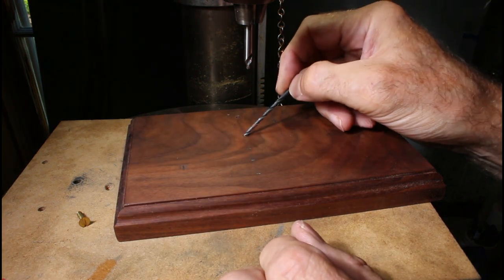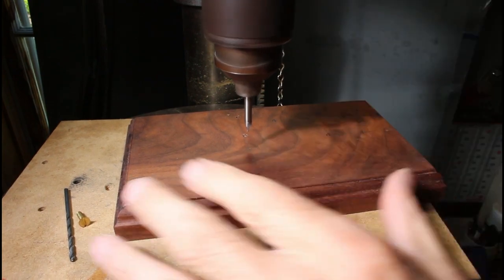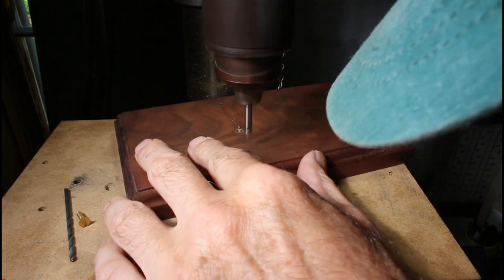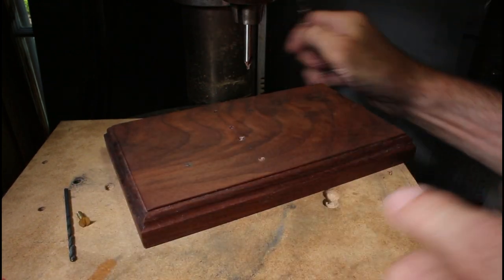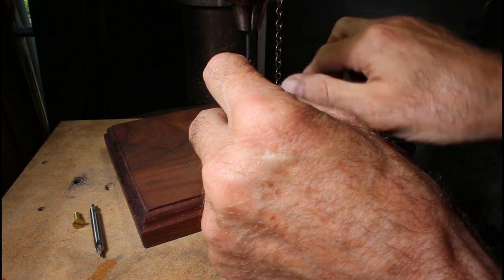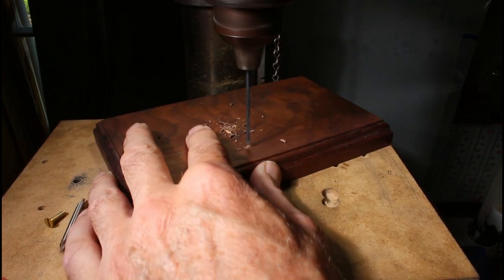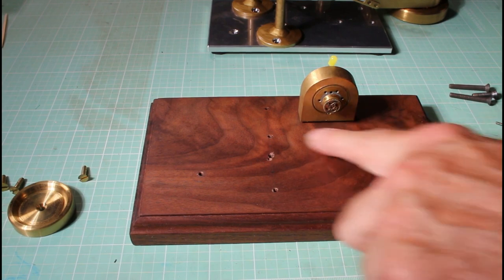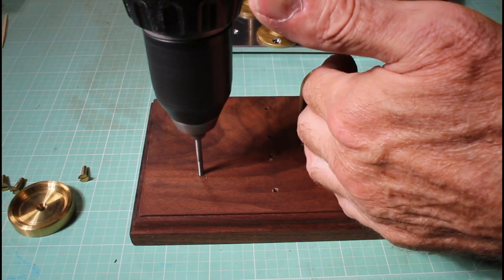You probably noticed that tap drill wander off on this hole, so I'm actually going to go all metalworking style here and do a center drill first. Then I can put my tap drill in there — just like working with metal, except it's walnut. I'm drilling all the way through, so it's just going to be easier to tap into there. I've got all these holes drilled and they all need to be tapped out to number 6-32. Easy peasy.